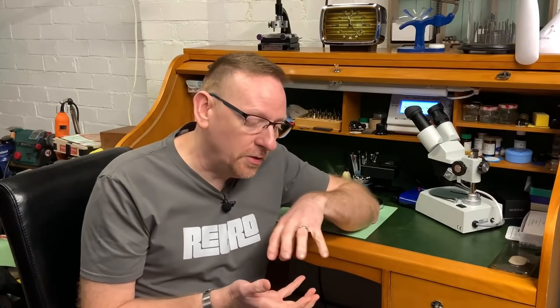But first of all, there is a little tip I want to say before we start, because in this video I'm just going to be building the whole thing. But if you're going to follow along to this, I think it's important that you build just the train of wheels, put the barrel in, put the train bridge on, put the ratchet on, and then you've got to put the chronograph bridge on just so it'll hold the chronograph wheel, and then put the balance on and make the watch run, just like you'd do on a normal service, really, for a normal watch. Make sure that the train's working well, and you can test it on the timegrapher if you've got one.